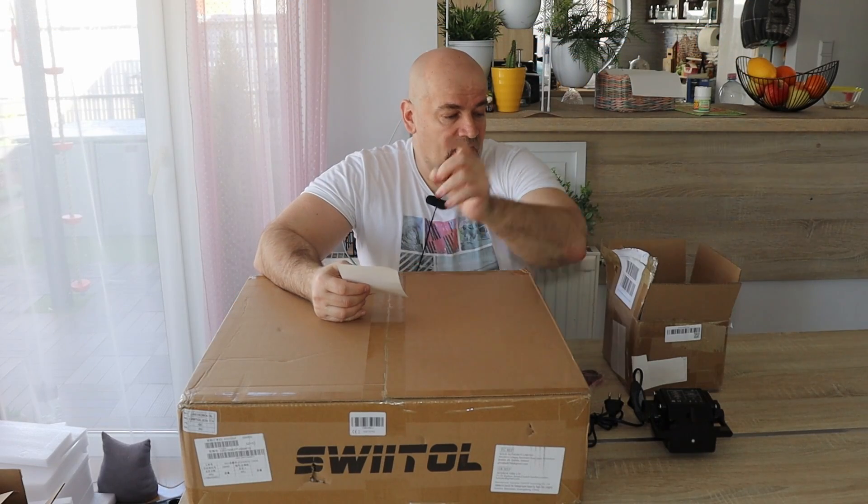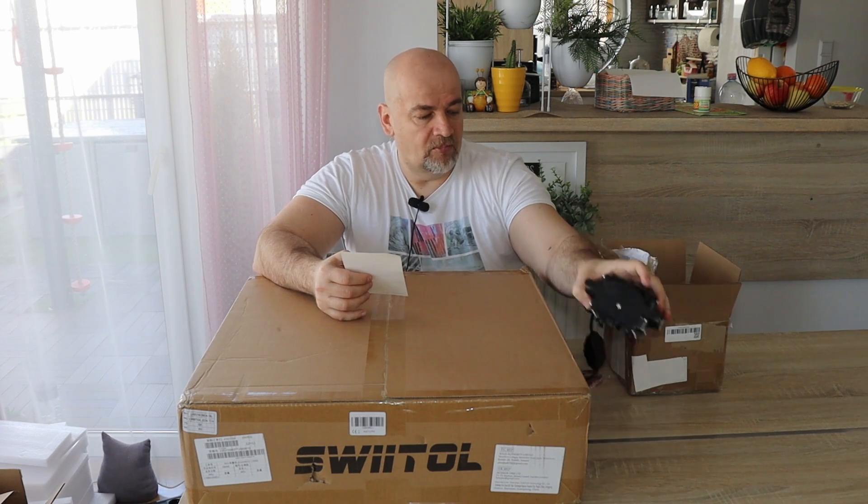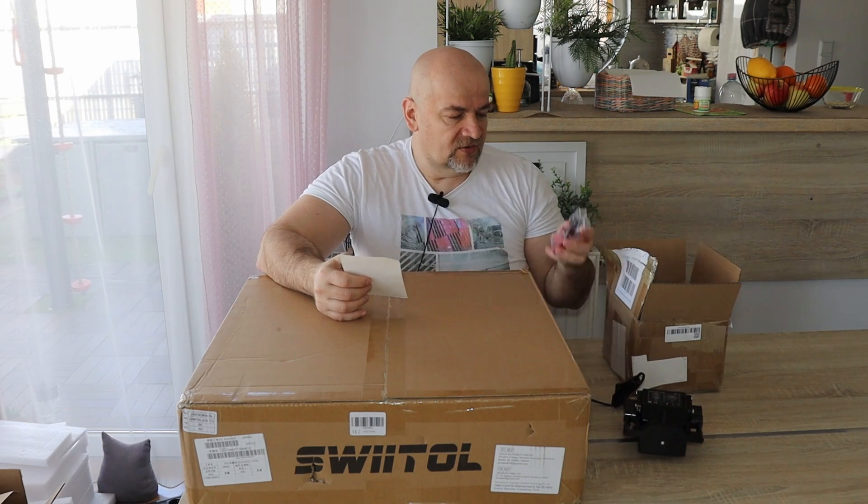Separately I got an air assist kit. This is the pump, and this is the air assist nozzle with some pipe, because originally this doesn't arrive with the air assist pump. I suggested they sell these two things together, because with this 24-watt you want to use it for cutting too. Cutting wood is much safer with the pump and air assist because it reduces the risk of flame.